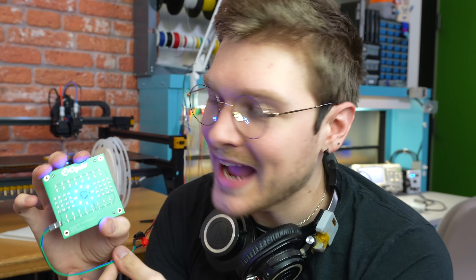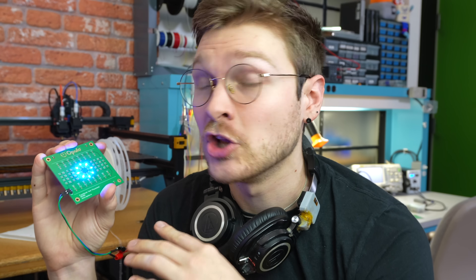I want to keep exploring this, but I don't think it's quite robust enough for a real application yet. There are two main problems: one, it dries too fast — it needs a longer stencil life, more time on the PCB before drying. Two, it won't wet to the surface of a component and it's not an adhesive — it's a paint. Even though it's much better than Total Ground in terms of stickiness, it still isn't great. I want it to be like a glue. So in the next video we're gonna play chemist and mix our own.